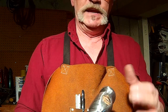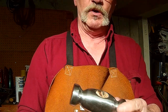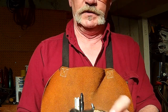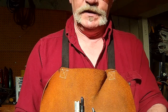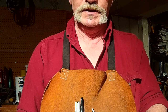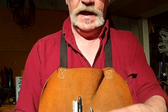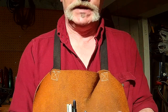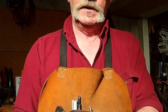And I don't have the means or the drift or a striker and all that you need to punch a hole in a piece of steel, or I'd just make my own. Maybe one day I will. I may just take it upon myself to punch it myself. You can always drill a couple of pilot holes, and then all you basically have to do is knock out that middle and drift it out. I can make a drift. So I may get set up to where I can actually just forge my own hammer. It would be kind of fun. But for right now, this one works really well. I'm really happy with it.